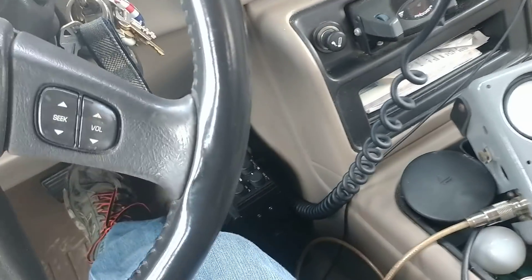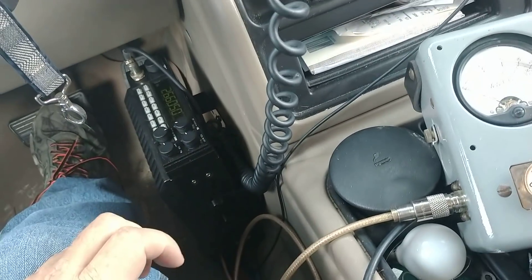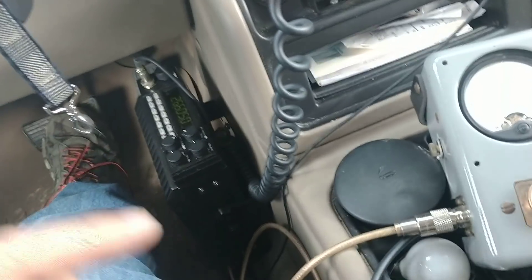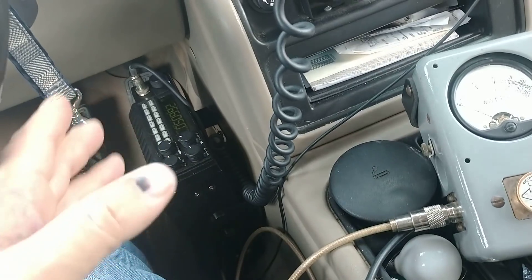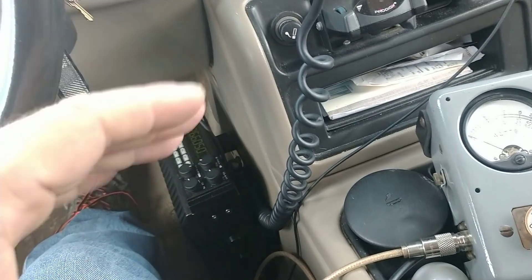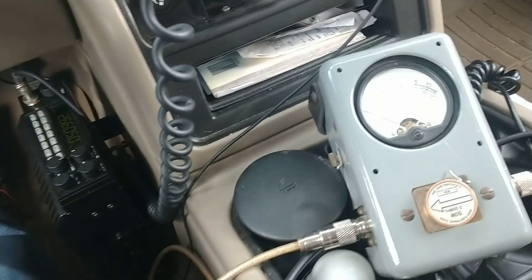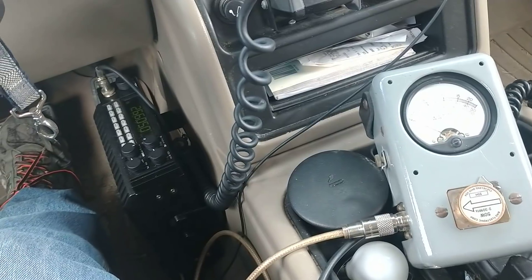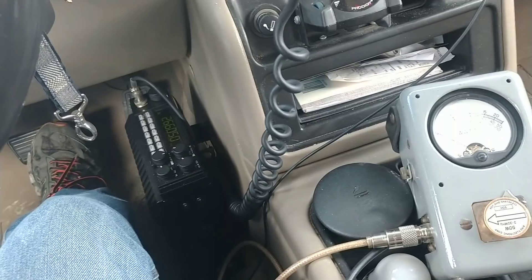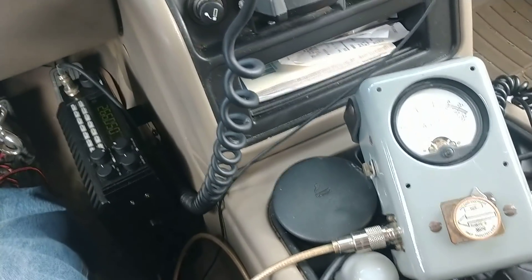I hope this was informative. I wanted to show you that just because you put an antenna on a vehicle and can't get the SWRs down, you have to find out where it's resonant. If you have a 10 meter radio and no antenna analyzer, you can use your export radio to sweep the frequencies and find out where you're resonant. If you do not go resonant anywhere — if it keeps going down and down and doesn't change — well then you don't have proper RF grounding. If it's not good anywhere, you don't have proper RF grounding, or your coax is bad, or something's just not right. I hope this was informative — y'all be safe, be careful, be kind.